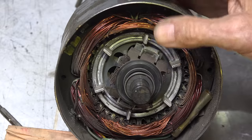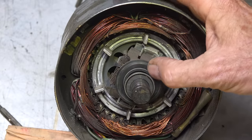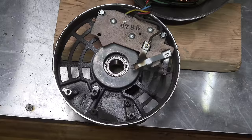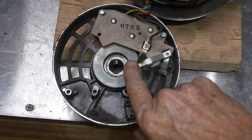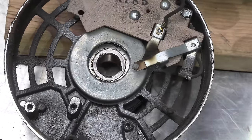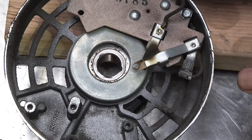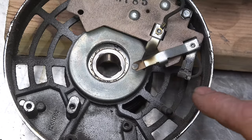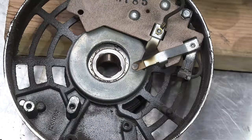When the motor is off, the start winding will be engaged — it has to be up to speed before dropout. Looking here, you can see the start contacts, which are kind of burned up in this one. They're normally closed; this rubs on the disc that is the centrifugal start, and it opens those windings when the motor gets up to speed. Pretty simple operation, nothing really special.